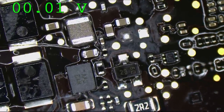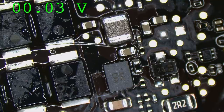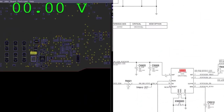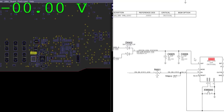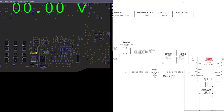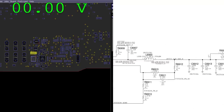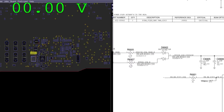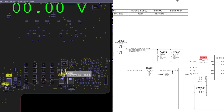Okay, it looks like this area has been fluxed, reworked, chips replaced, and all that good stuff. So we're just going to check a couple of things before we go replacing things. The first thing I want to do is see what is present on the input of the chip, or on the supply pin. Usually you see voltage in or VIN on the top, or VDD or VCC. Here it's a little different. Here it's SUP. And SUP does not mean supper, it means supply. Although it could also mean supper, as in the chip needs to eat in order to create its power. The same way I'm not going to fix boards unless I get my burrito. This chip needs its supper in order to create PP3V3_G3HOT. So first thing I want to do is see what's coming in on pin 2 of the chip. We're going to check pin 2 of the chip and see if we have what we're looking for.